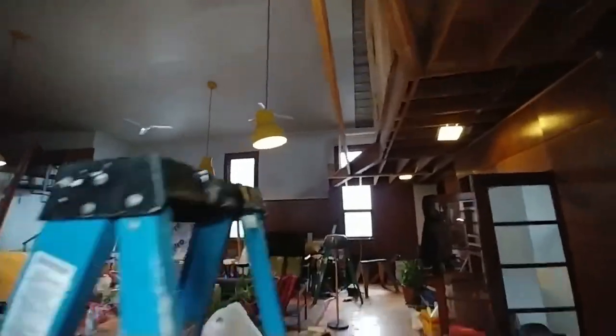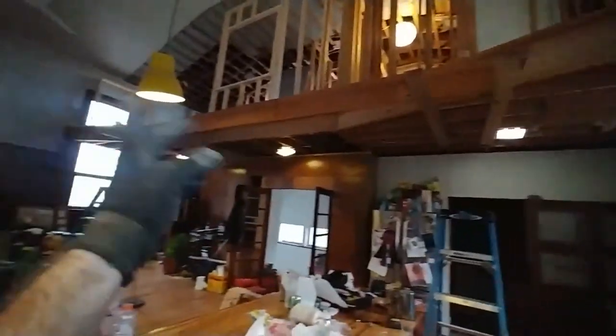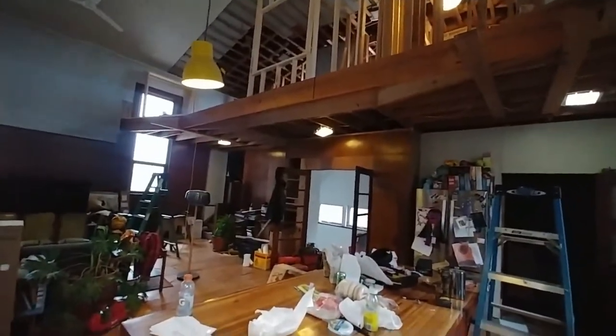But there's the toilet coming over and tying in there, and the shower there. Oh, and then we got our LVL up. So he went up pretty easily. I put that angle on the ends of him. We put a couple of cleats on there after we cleared the furring off, like I was saying. And then we both went up a ladder and just set him up there.